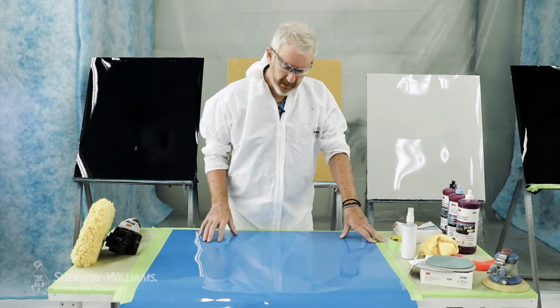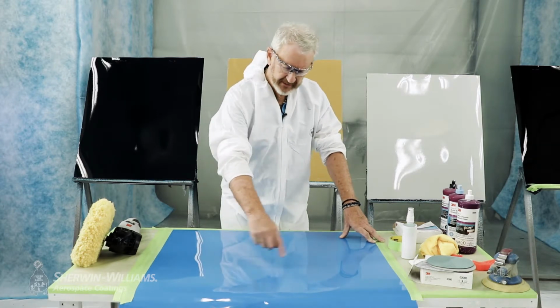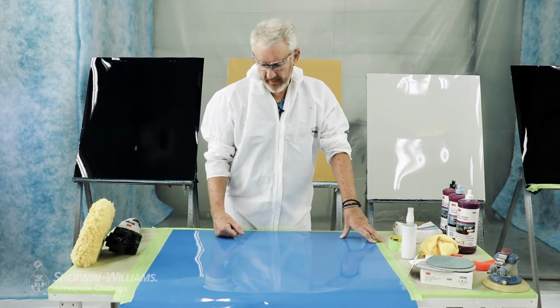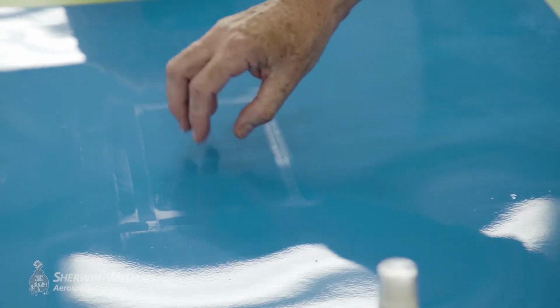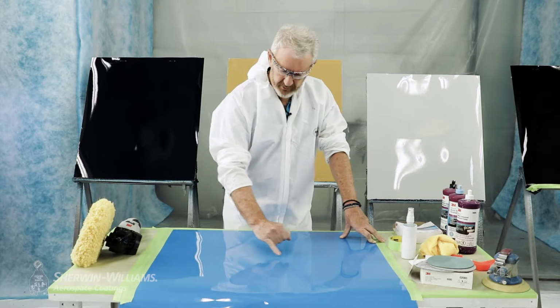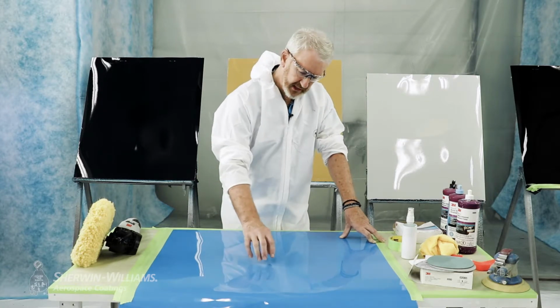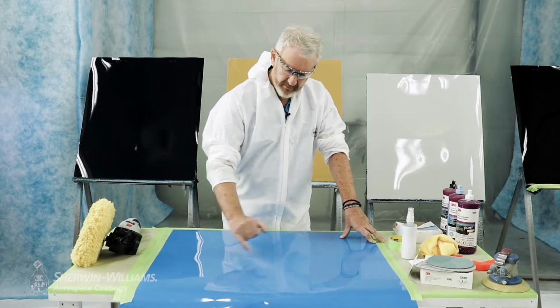Okay, so on the edge repair that we did, you saw the innovative masking and back masking that we did to achieve this envelope of clear. What we've got here, and it's very important on repairs, is to try and retain in the body of the repair the same profile as the surrounding area. We're going to do some more innovative masking. We're going to sand, denib the body of the clear, the fresh clear. Then we're going to demask to the outer layer of the masking tape.